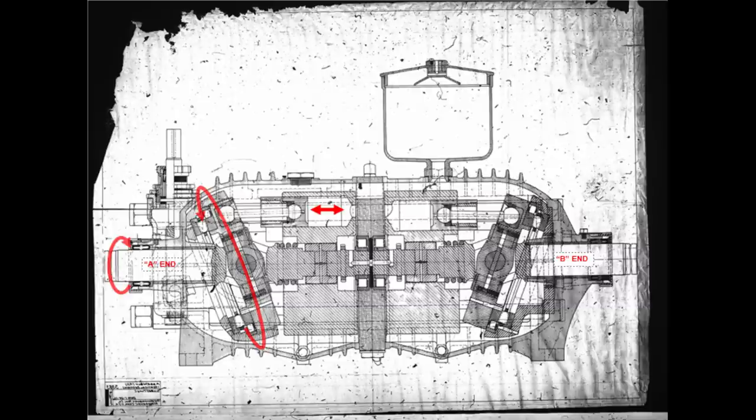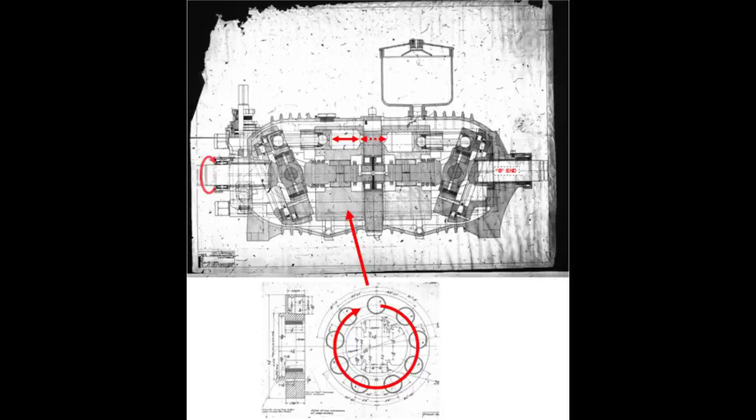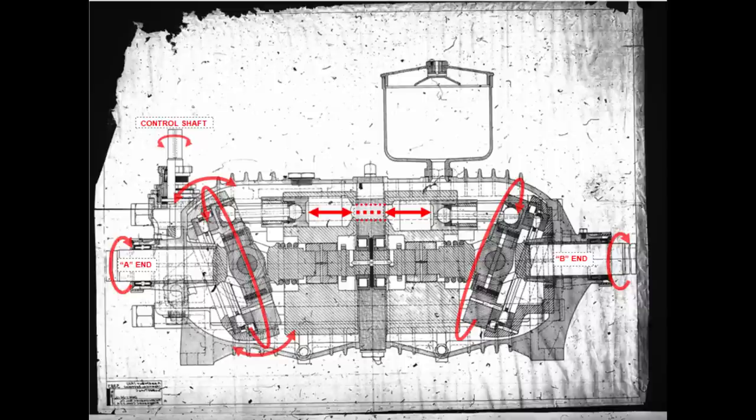In the internal diagram, an electric motor turns the A-end or input shaft at a constant speed. The shaft is attached to a tilting box that pushes against a series of pistons arranged in a circle. The tilt of the box creates a wobbling motion as it rotates, pushing each piston in and out one after the other. If the box is tilted one way the valve sequence runs one way; if tilted the other way the sequence is reversed. As a piston is pushed, it shoves fluid through an orifice plate called a mid plate that separates the A-side pistons from an opposing set on the B side. Since the A-side pistons are pushed in sequence, the fluid pumped will push B-side pistons in the same sequence. As B-side pistons are pushed in and out they push against another box that is tilted but not adjustable, and the attached B-end output shaft will rotate in the same direction as the A side.